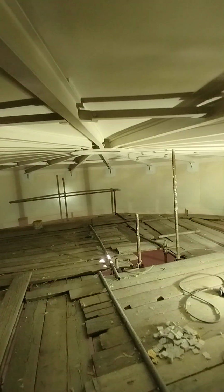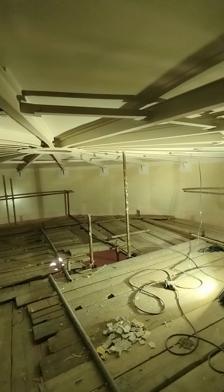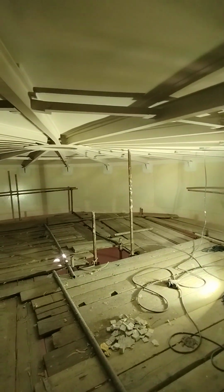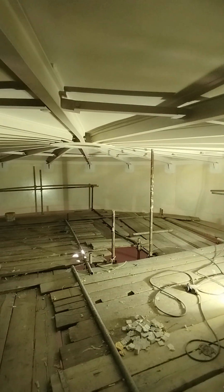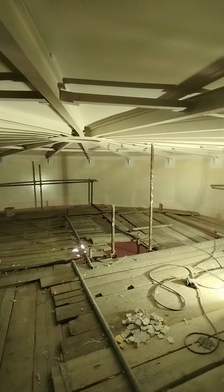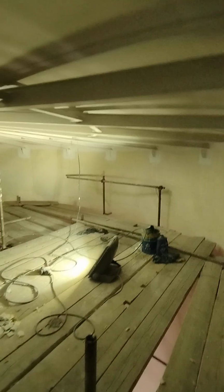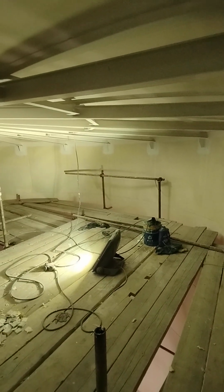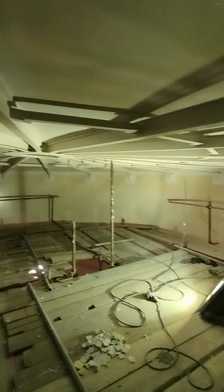So this tank was used to store demineralized water, and the designer had to figure out that demineralized water is hazardous, or better said, that carbon steel is not a good material choice. Usually they choose stainless steel metal to use in the body of this storage tank.